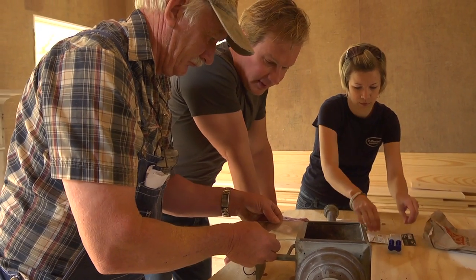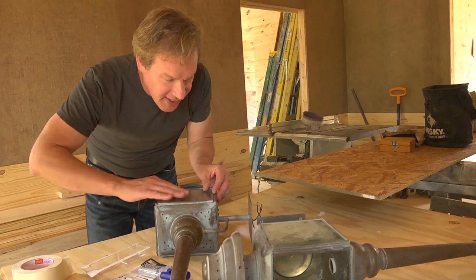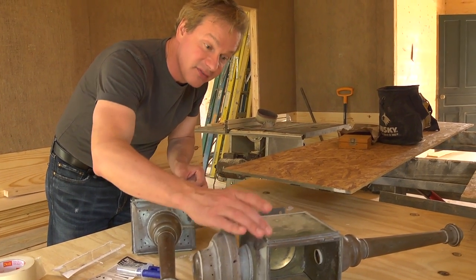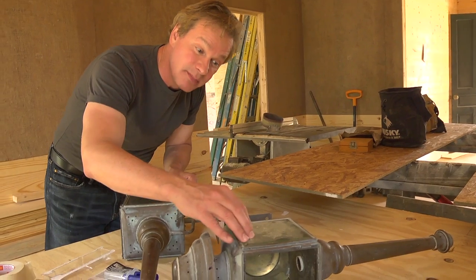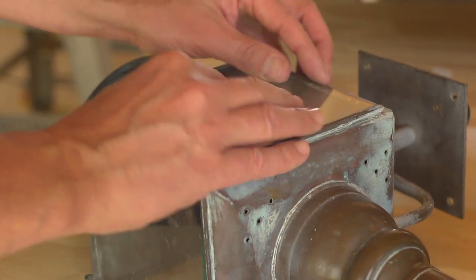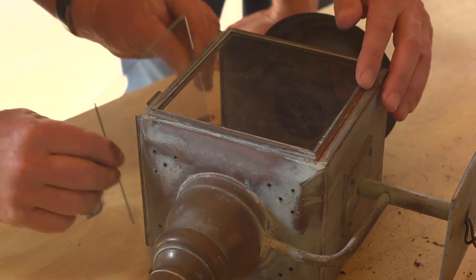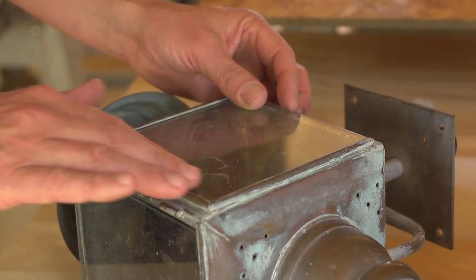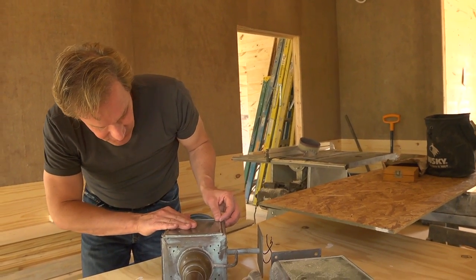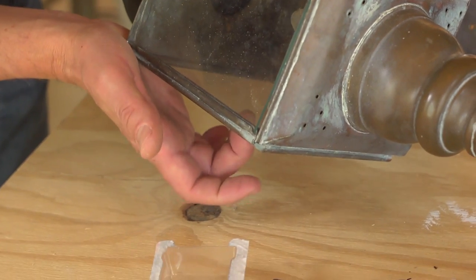What Tony did is he actually measured the glass, and on the sides we took the broken pieces of beveled glass out. Eventually what we'll do is take this beveled glass out as well, because we can't match it. On the sides, what we have here is a piece that is 5 and 7/8 inches square — it's an 1/8 inch piece of glass on each side, as you can see here.